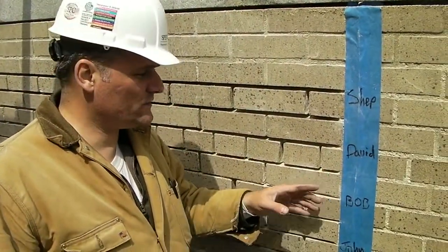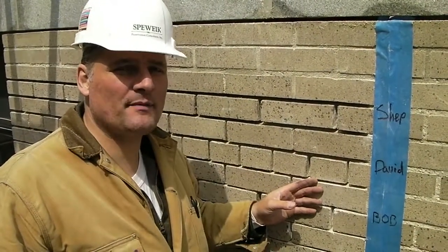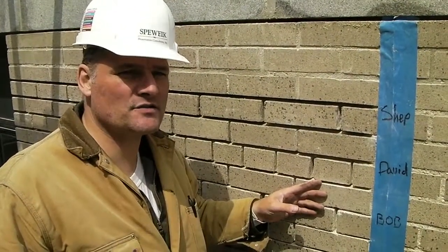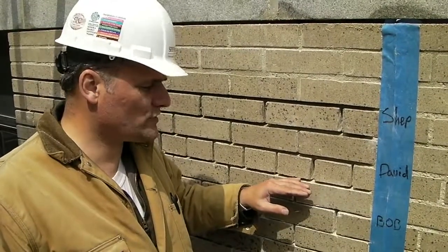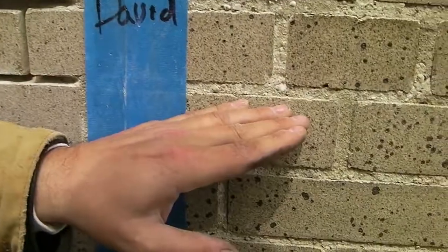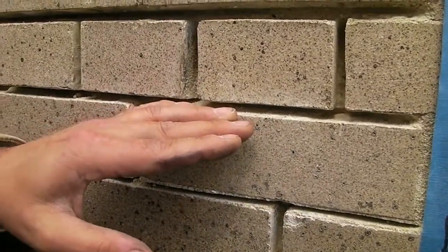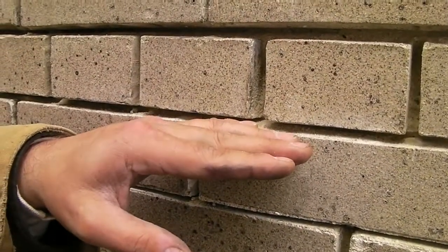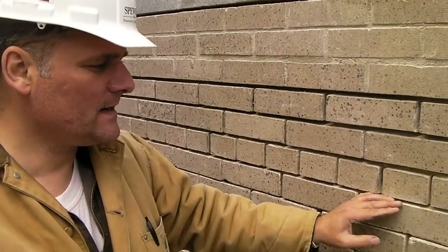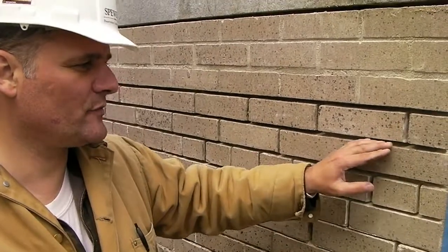We're at 1 West Wilson and we've just finished cutting out the mortar joints and prepping the wall for pointing for tomorrow's training. You can see here the mortar joints have been removed. This is what the original mortar joints looked like before we removed them. We used a combination of the center cut method, followed by a hand chisel and 5-in-1, then pneumatic chisels, and then a needle scaler as well in the process of removing the mortar.